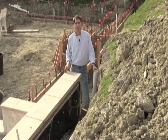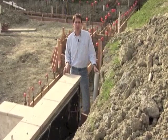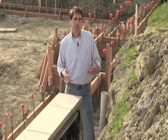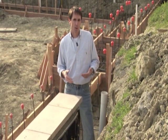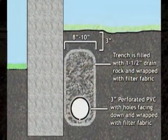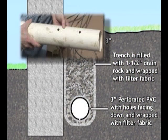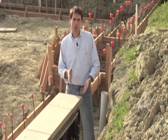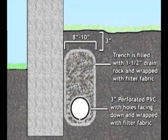Retaining walls have a few common elements. Whenever we have a downslope into the back of a retaining wall, we want to relieve the pressure that builds up from the weight of water behind it. What you see here is a French drain configuration. Looking at the diagram, there are three elements: perforated drain line at the bottom to collect water as it settles, gravel which allows air to enter so water drops to the bottom, and a filter cloth wrapping around the gravel bed and pipe to keep debris from clogging the French drain.